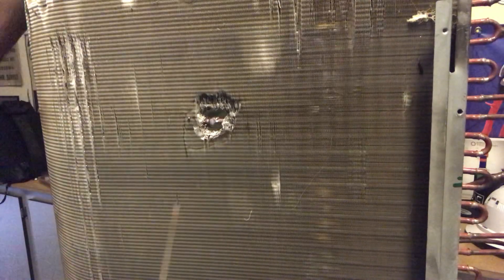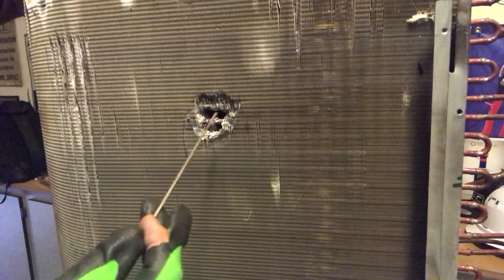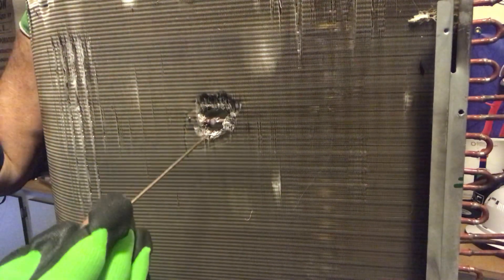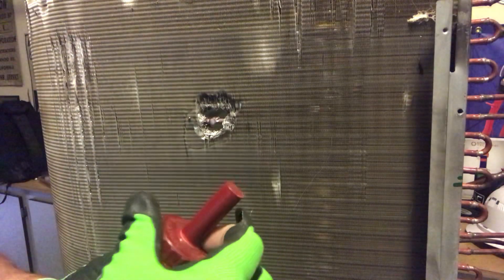What I'll do is cool this area down. Now there's a hole, but it's not that big — honestly you're not going to lose any cooling efficiency. The condenser fan will still pull through here. But if you really feel you need to, take silicone and put it on the backside, then put duct tape on the backside of the coil and fill in that gap with silicone after you've leak checked it. For leak checking, I use the Big Blue brush-on, which is the micro leak detector — you can unscrew the dauber and dab it in there to find even very small leaks.